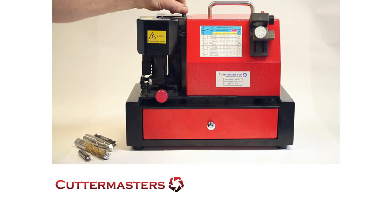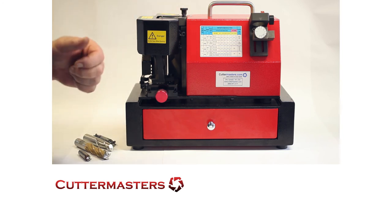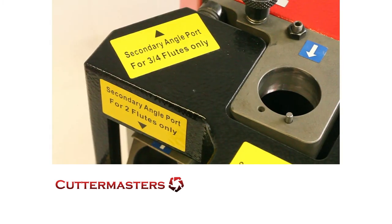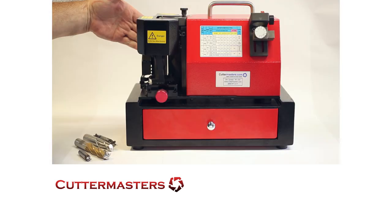The back split shelf is here — you cycle it through all four of the flutes and then you can go over to the secondary port which is a clearance port. Secondary grinds are just clearance, so they're not that important as long as they're out of the way and you've got good clearance around the center of the tool so you don't crowd your chips. On these machines this is the three and four flute secondary port, and this is for two flutes — these are just secondary grinds.